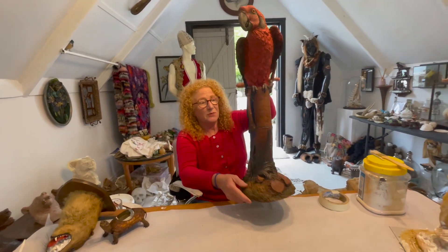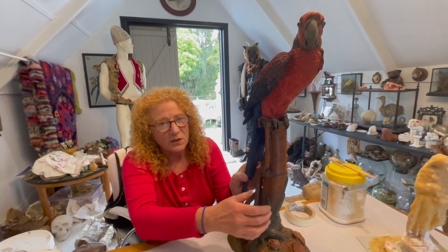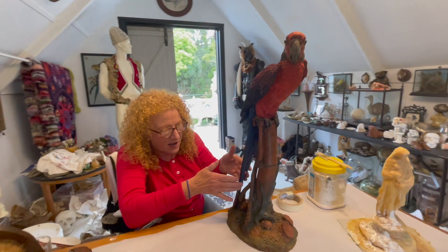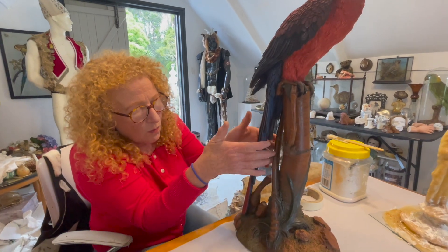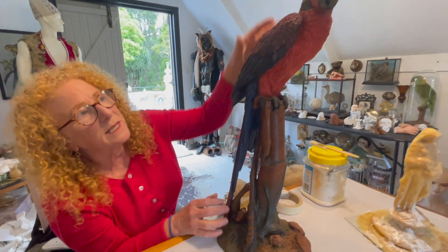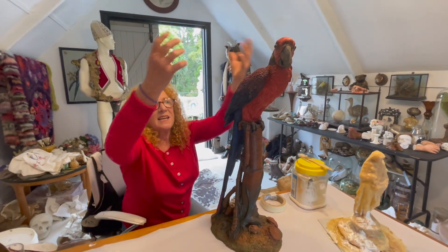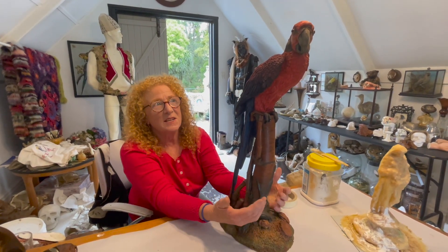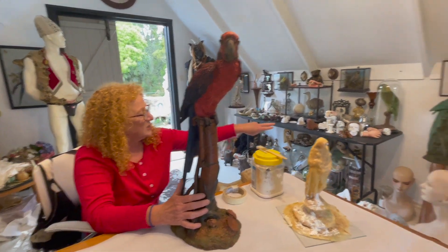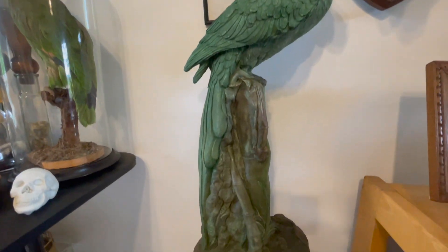The last point on the latex I'd like to explain is this resin parrot — lots of gaps, it even has a gap in its mouth. What I got was some kids' plasticine and I just made a fake wall — not very thick — filling in every gap. Wall came down to here and I popped a little ball in his mouth, and then I could latex the whole thing. You're never going to be able to pull it off like a sleeve if you've got latex in all the gaps — it's just absolutely impossible. So fill your gaps before you start.